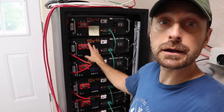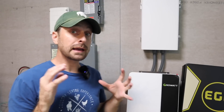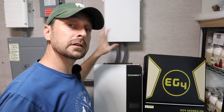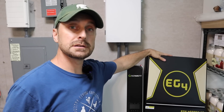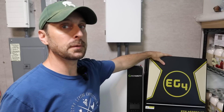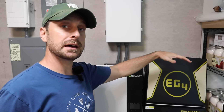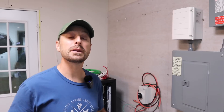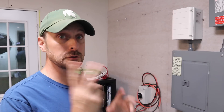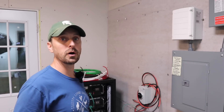If you're looking for equipment like these batteries and our new inverters, I'll have the link in the description below. We're not getting into the full build today — that will be in the next video. What we will be doing today is cleaning everything up and spacing everything properly. The EG4s require about the same spacing as the GrowWatt: 20 inches on top and 8 inches on the sides. But they're bigger, so that's why I need to move everything. Plus in the future I plan on getting two more EG4s, so I had to calculate where those will live on the walls.